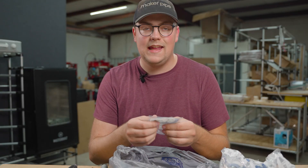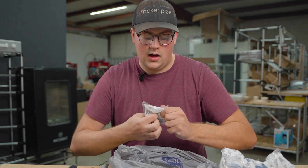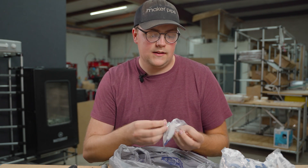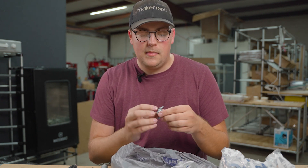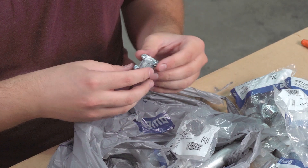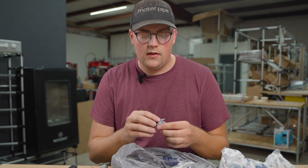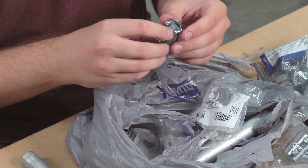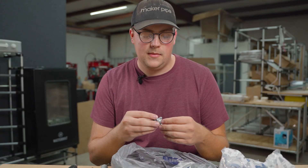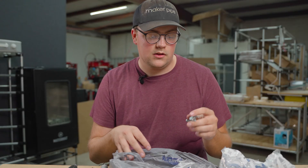This is an EMT to NM coupling. EMT conduit is all we've been talking about today, but just like with the flexible conduit adapter, this one also has an adapter — it basically allows you to cinch down on non-metallic sheathing wires and cables. You secure the conduit in the connector with a set screw, and then the wire goes through this little clamp here. You use the screws here to clamp down on the wires, and it basically just secures the wires in place once they're coming out of the conduit. That's what it's specifically used for — another specific solution.